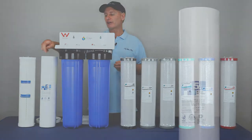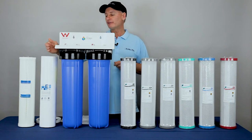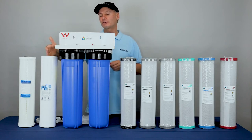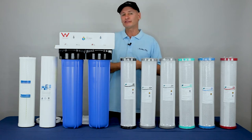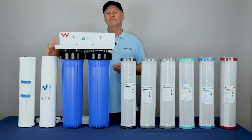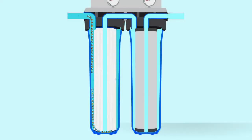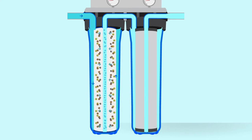This one here is a poly-spun sediment cartridge — more suited for use in the capital cities. There's plenty of dirt, sand, and fine silty clay in our capital city water as well, generally very fine, so that's why we prefer to go with the poly-spun sediment cartridge here. It can load up and get rid of that sediment for the city application. So for rainwater I'd be looking at a pleated, and on the city a poly-spun into position one to remove all sediments before the water flows into the specialty cartridge in position two.